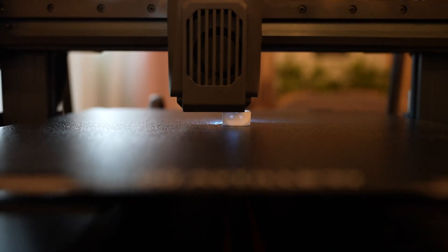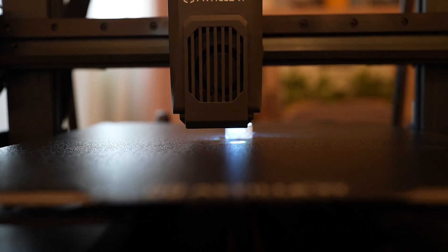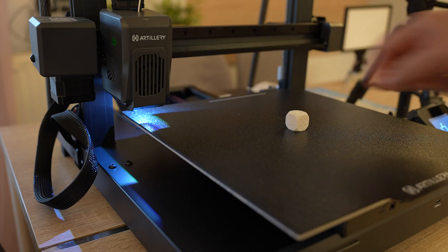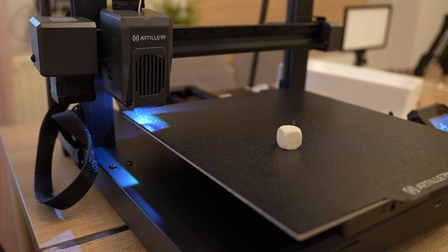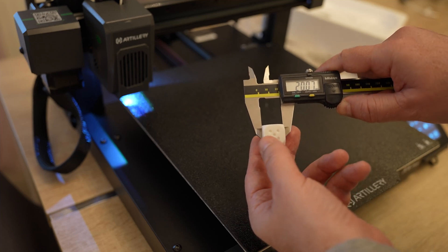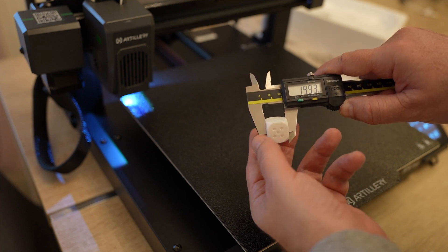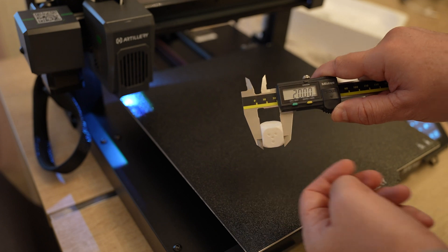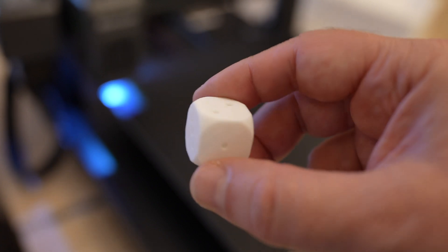The printing looks very slow due to the minimal layer printing time. I increased the speed to 150%. Printing is finished — bed adhesion check: good. The bed cooled down to 40°C. Checking dimensions: along Z-axis 20.07mm, along Y-axis 19.93mm — a little smaller — and along X-axis it's accurate. Surface quality is good too, but it's hard to show on white filament — I'll switch color later.